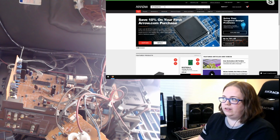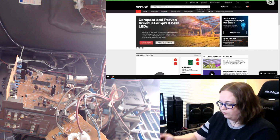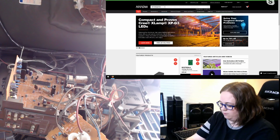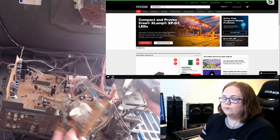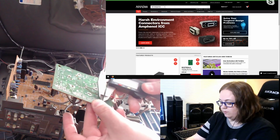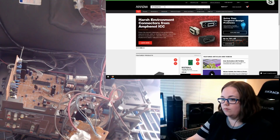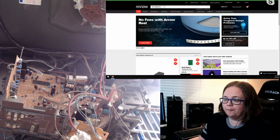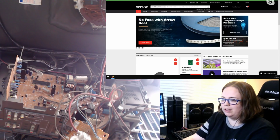Also, do any of your caps have any clearance issues too? There shouldn't be, so height should not be an issue at all for these. It's terminal pitch, that's what they call it. Terminal pitch is what they call the distance between the pins. So, the terminal pitch on this one is about 2 millimeters. I'm looking now and I can't see a single capacitor where height would be a problem. Okay. So I don't even think we should bother with that, to be honest. I know that's more of a thing for consoles or power supplies. Power supplies, yeah.